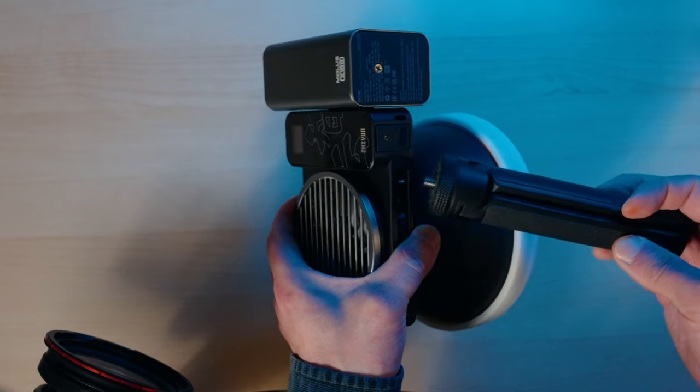The next problem I found with this light is actually present in a lot of budget LED lights — when you turn it down really, really low, the color temperature sometimes changes as you get brighter. I found that at 5,500 Kelvin, going from 6% to 7%, the color temperature changes slightly. It's not a huge deal because I'm rarely going to use this light at that range, but something to be aware of in case you want to get creative. Those are minor things.